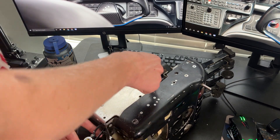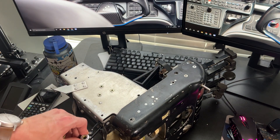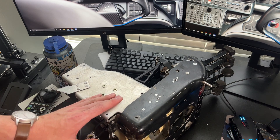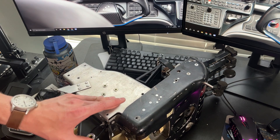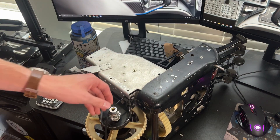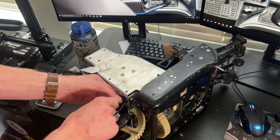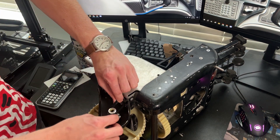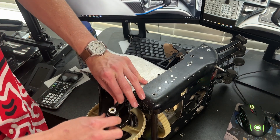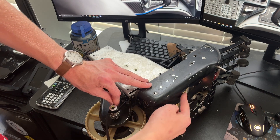We have this mechanism right here. It gets routed through here all the way through our tensioner to the face itself. When we rotate this, the idea is that it all rotates together. Of course I haven't tensioned it yet, but the idea is that you rely on the potentiometer. I'm either going to purchase a sprocket and mill it out or 3D print my own. I just need to be very careful to make sure that these teeth work well. The big thing we want to avoid is any slippage — if the wheel is moving but the belt isn't, our indication will be messed up.